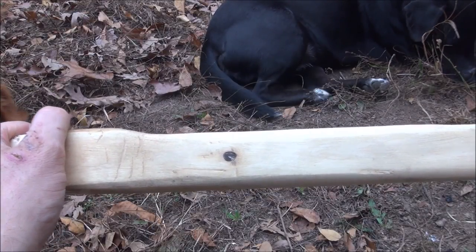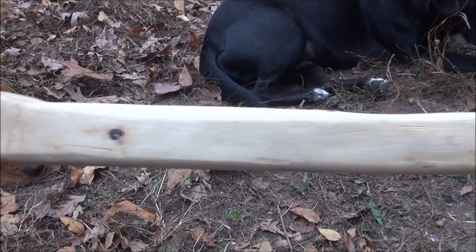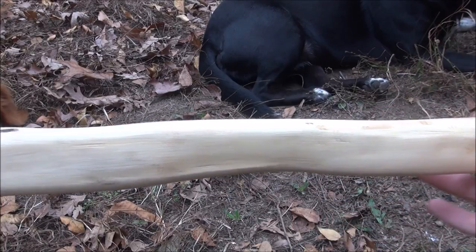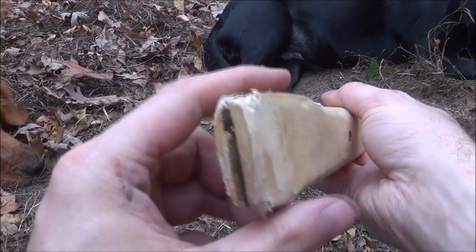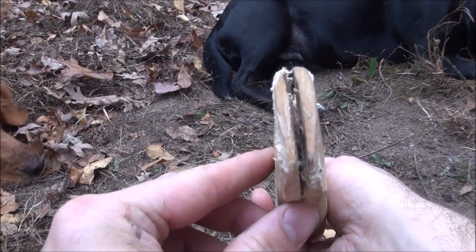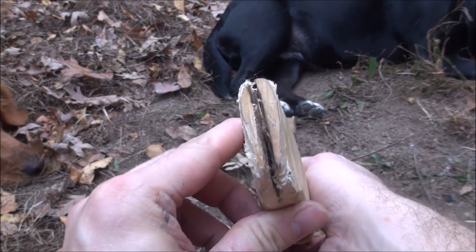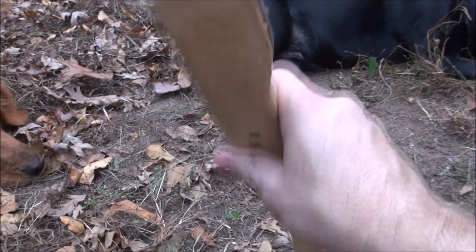All right, we've gone ahead and made us a pretty decent looking axe handle here. I did sand it some, just carved it into a shape that I like. It doesn't have to look like this — it can be just a straight stick if you want — but I wanted to give it some character. Something else I've already done is I've cut down the center here, so we can make a wedge. Once we get this in our axe head, we can take that wedge and hammer it down in there, and that's gonna make it a really snug, solid fit that's gonna last a long long time, especially with a hardwood like hickory.